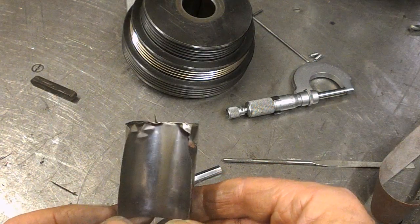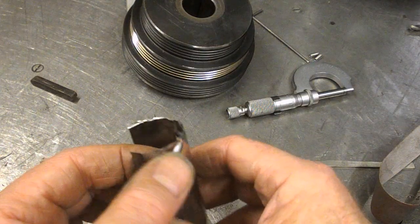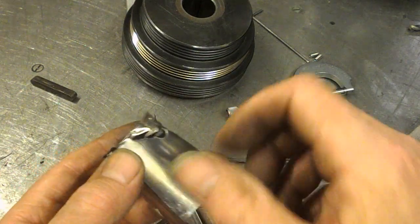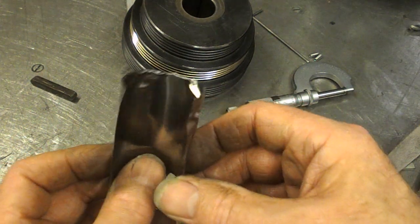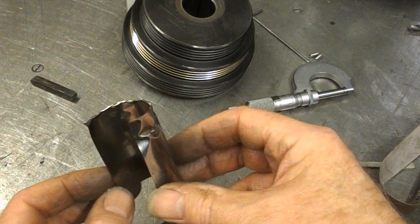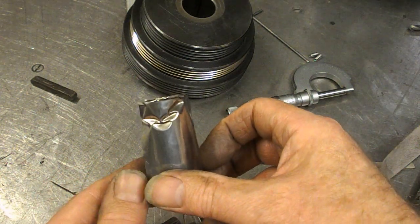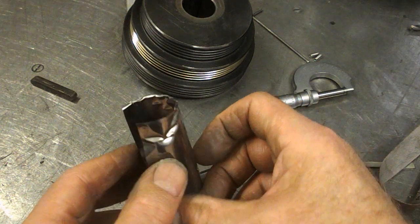I just pulled the pulley off the motor shaft because a bit of shim was wrinkling like mad and there was no way that was going to go down. So I have two minds now whether to try again with another piece of the same stuff or try a bit of slightly thinner. The whole point of putting the shim in there is to stop the pulley wobbling on the shaft, so it wants to be a good fit — but yeah, maybe this is just a bit too good. This is four thou; I'll see if I've got some three thou stuff and see what that does. Might work lovely. Might allow a bit of wobble on the pulley still, but I think I might go that route.